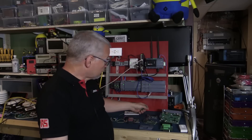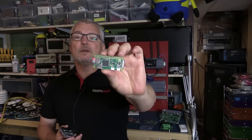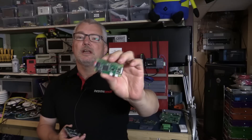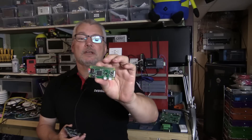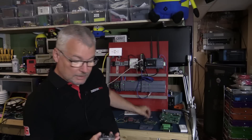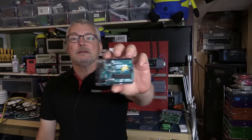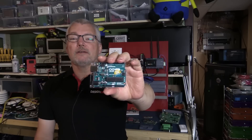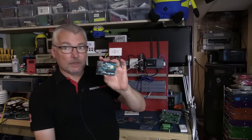My view is it's probably the equivalent of the Raspberry Pi Zero, because from a Unix/Linux perspective they're about the same. They're both running a gigahertz processor, both single core, both have half a gig of memory. The RPi Zero happens to have Wi-Fi on it as well. The IoT 2020 and 2040 also have an Arduino Uno header, exactly the same kind of header with the same pinout, and there's a jumper so you can switch between 3.3 and 5 volts.